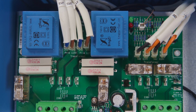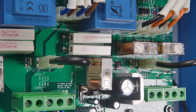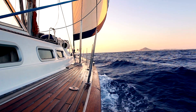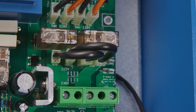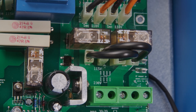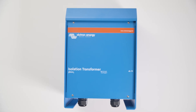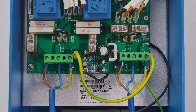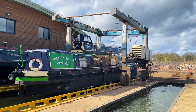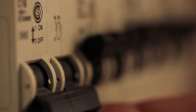Some models of the isolation transformer work with both 230 and 115 volt supplies, making it an ideal solution for vessels that navigate globally with varying voltages. Using the jumper cables, you can customise both the input and output supply depending on your needs. In our installation example, we have selected a 230 volt in and out supply. On the auto model, the input voltage range is selected automatically. There are also earth bypass options if you are out of the water for winter or maintenance, ensuring correct earthing. The final jumper is to select if you're making a floating network or a network fit to be used with a residual current device.